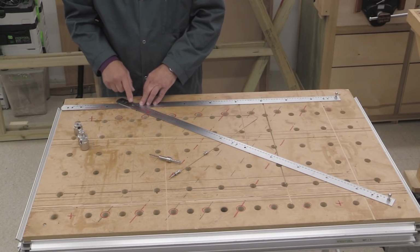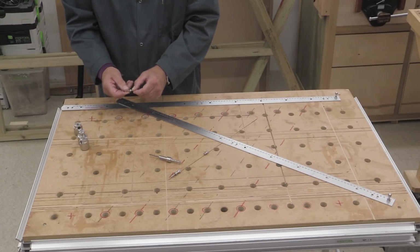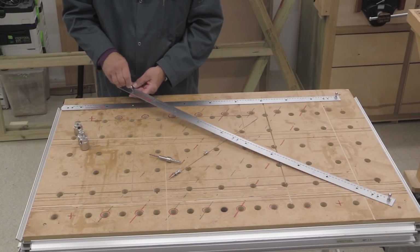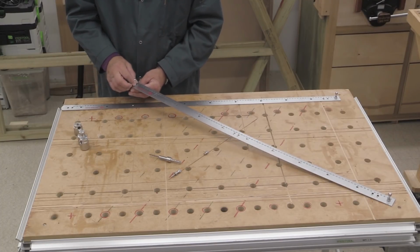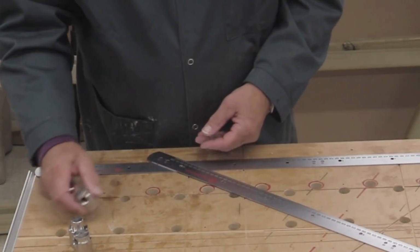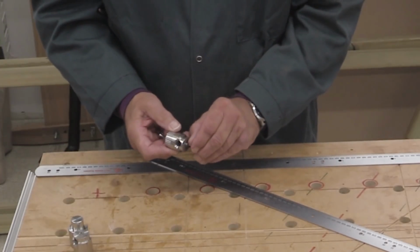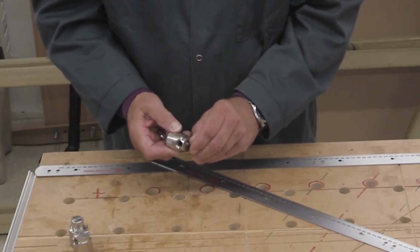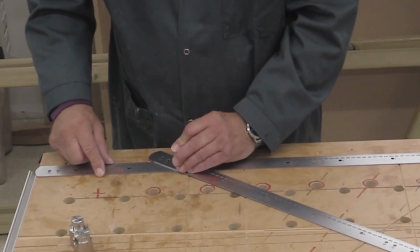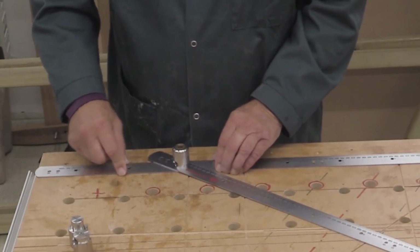In order to go through 2 rulers, one of these pins only has enough of a collar to go through 1 ruler and to secure it. So there it is in the collar there, but there's no collar going further on. But if you were to take the 3mm drill guide, which has got the long collar here, which can go through 2 rulers, that's that. Those are now located.